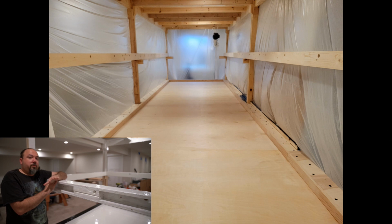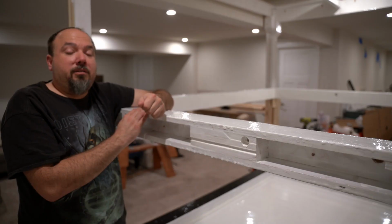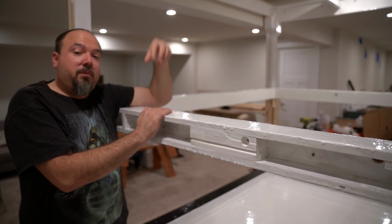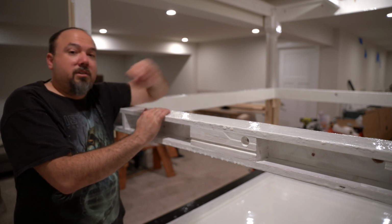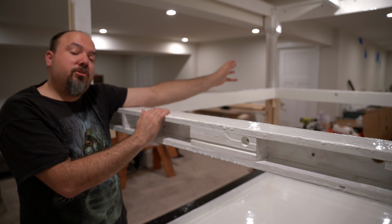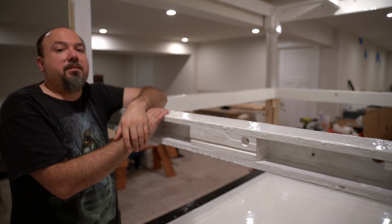And it's very important, if you are doing something like that, that you think about the negative pressure you could be causing in your home itself. If you have furnaces, hot water heaters, or any appliances that use a regular chimney pipe, you just got to be very mindful that you're not sucking so much air out of the house that you reverse a chimney. That's really bad because you could suck carbon monoxide in your house.